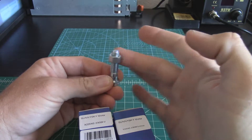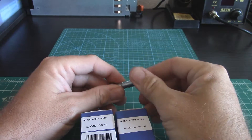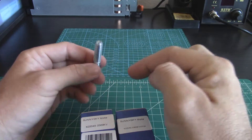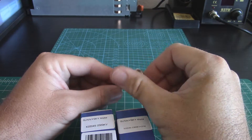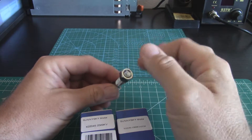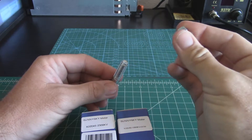That's the same as using a lock nut on your prop shaft, or the aerodynamic nose cone type things that come on the motors. The clockwise indication on the motor means the threads tighten the nut by going clockwise. Counterclockwise means a left-handed thread — turning it to the left would actually tighten the nut.